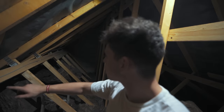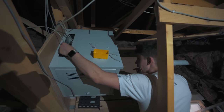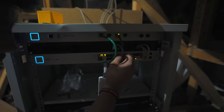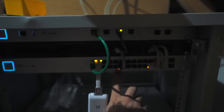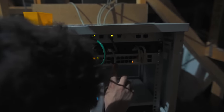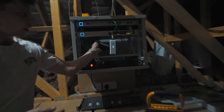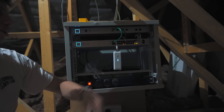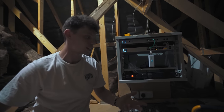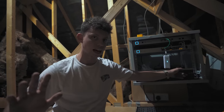As you can see, we have run the cable from the camera which is literally just on this B pillar of the house right here. I'm going to run it into the rack and then plug it into the switch, and as you can see the switch has come on — it's supplying power over Ethernet to it and hopefully we should have a green flashing light. Essentially all I'm going to do with the NVR is plug its power brick in and connect it with an Ethernet cable into the network. So the camera and the NVR are both just connecting into my switch, into my network, and that is it. The rest is done via a web interface that you connect to via an IP address.